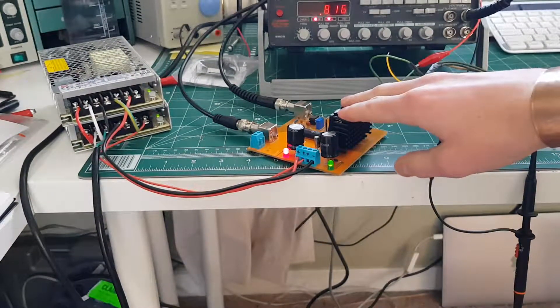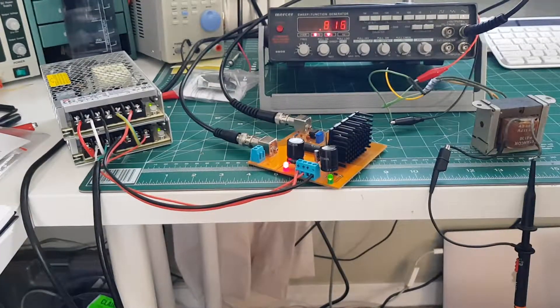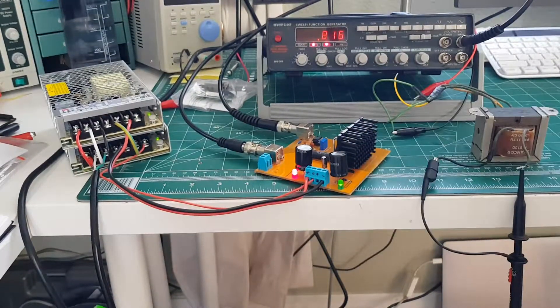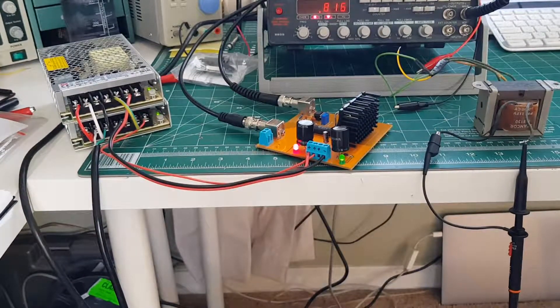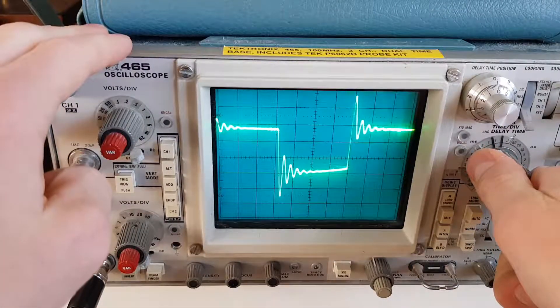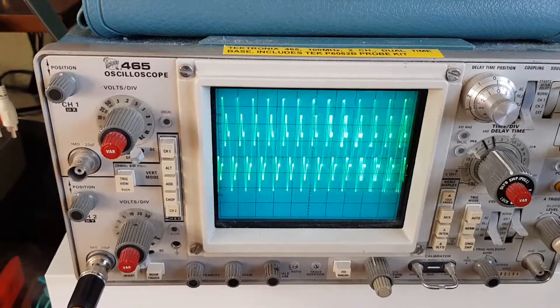This thing is current limited, so if you short it out or draw a load that's too heavy, it will stop it from completely burning up. That's set by this black 0.1-ohm resistor — there's a current sense lead on this op amp and it will limit the current. It's set at maybe just a couple of amps right now, like three or four. I hooked a 0.1 microfarad 600-volt film capacitor across the secondary of the transformer, and we're getting some decent ringing. If we identify the frequency of that ring, we can find the resonant frequency of the transformer.